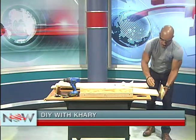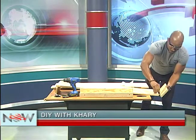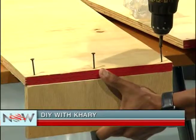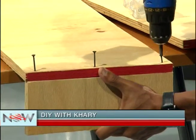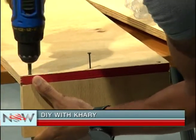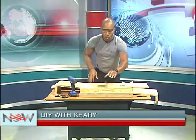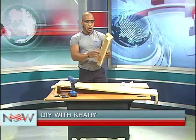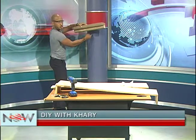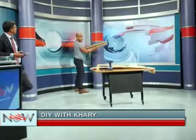This is only part one of the three-part series, so stay tuned next week to see how you get to the next stage. I pre-drilled some holes just so I could work a little bit faster on the show this morning — you may need to employ a little arm strength, but it's okay to do stuff outdoors and get active. At this point is where you'd want to put this brace against your wall, drill directly through it to make holes in the wall, then put your wall plugs if you're working with concrete, and use screws to fasten it to the wall.